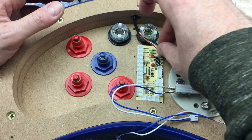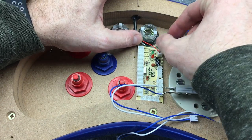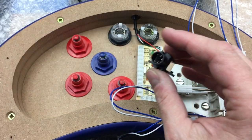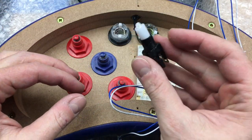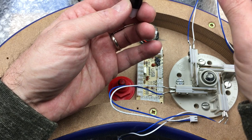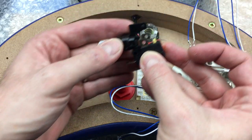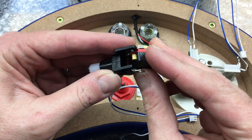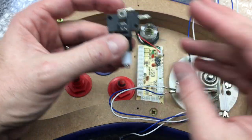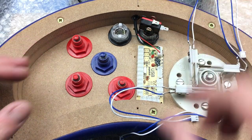The glue has cooled down a little bit. Now I'm going to start the final assembly — first plug in the USB. These buttons have a couple of parts: they also have a lamp which I'm not interested in wiring but I'll put it in anyway, and then I need a micro switch. The micro switch sits this way so it presses on this button. The easier way to get it in is to put this side in first, swing it in, lift it past that piece, and it clips into place.